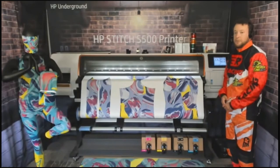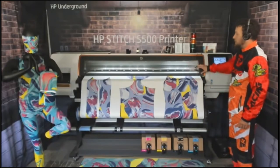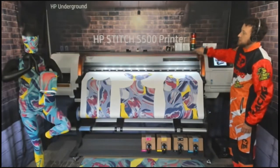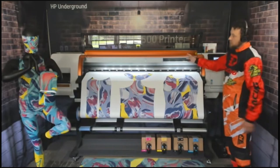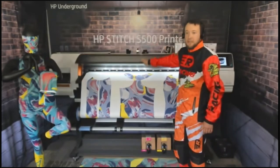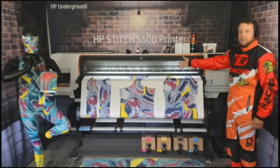The window on the front is a very nice feature. There's a light inside so you can see what's going on in the print zone. You have to keep this closed — a lot of sites I've been to like to print with it wide open, but with this printer we start heating in the print zone as it's printing, so it's a good idea to keep it closed. The window gives you visual access to the print zone.